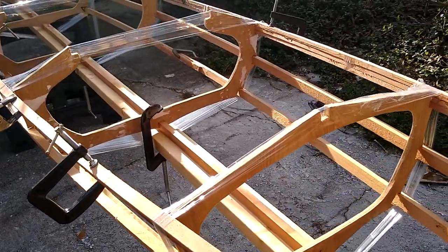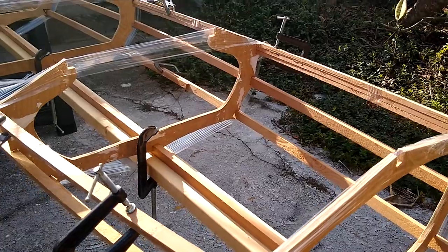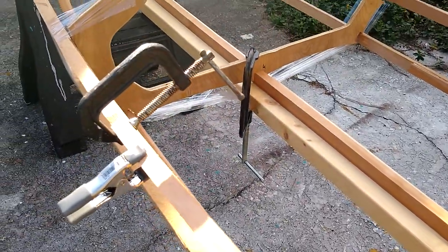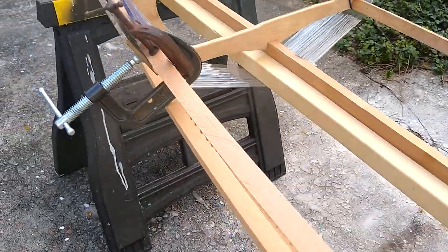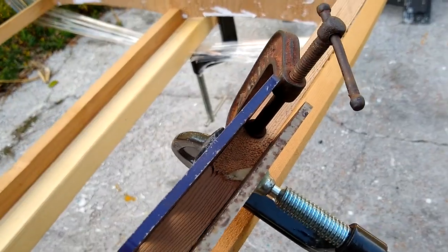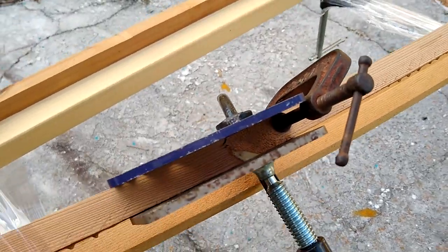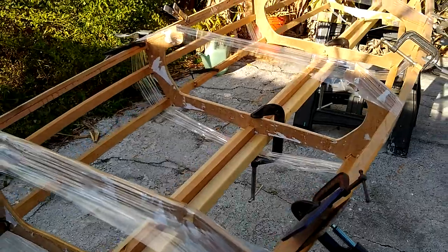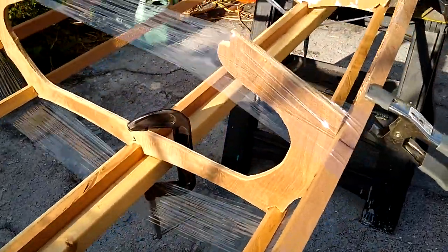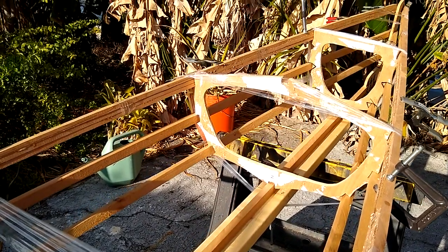But, you know, this cedar, maybe this is why they suggested you do it this way. The trouble is the cedar was starting to get weak. So the reason that we're only halfway here is because the board started to snap. And in fact, we had a snap here even after we tested everything. So I've got it kind of glued together in the hopes that we'll maintain some integrity there. But anyway, I think that before I even finish gluing the back half up, I might even start stitching and lashing some of these cross members in so that we'll have something a little bit more rigid.